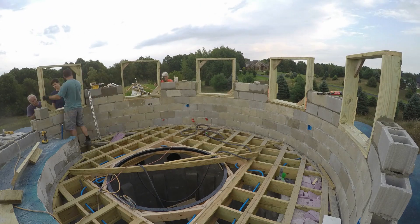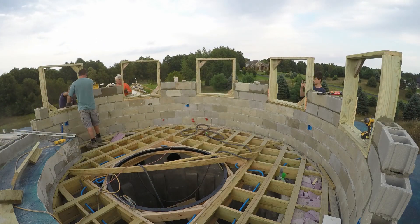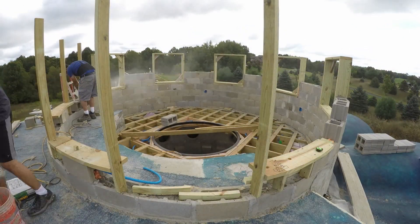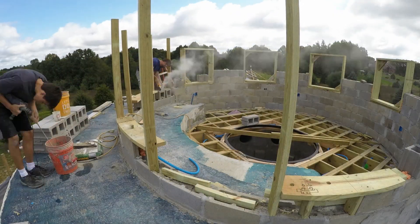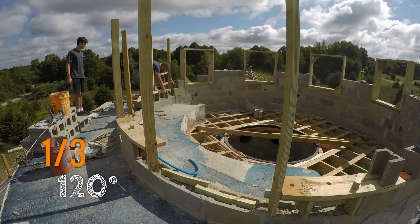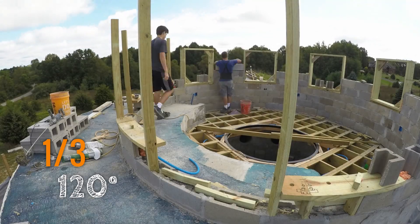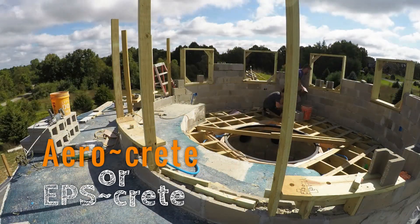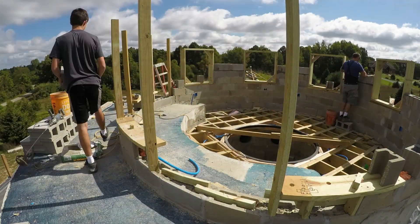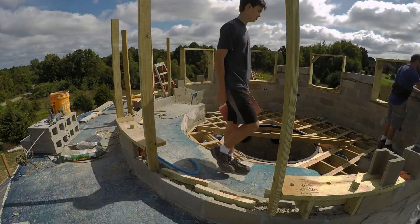At this point you're probably noticing that I'm only using the blocks on three quarters of the circle. Those blocks are over the very strong concrete radial vault arches that won't even notice the weight. However, on that last quarter, we're building on top of that flat roof section, so we're going to use a lightweight concrete with bubbles in it — EPS concrete or something like that — and that'll be the next video. For now, I'm just getting the window box in place, secured to the concrete at the bottom of the wall.